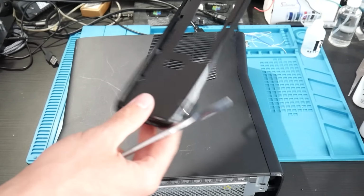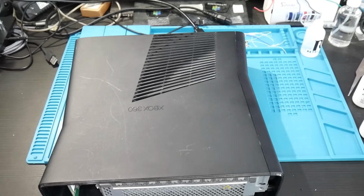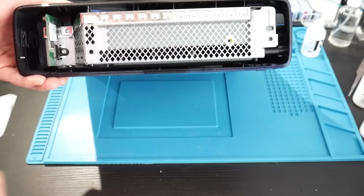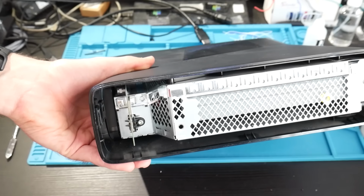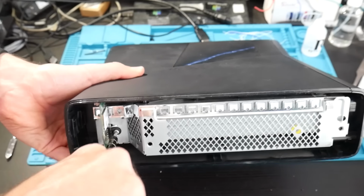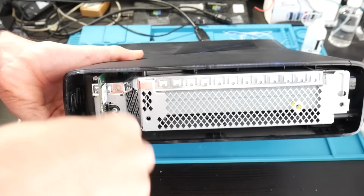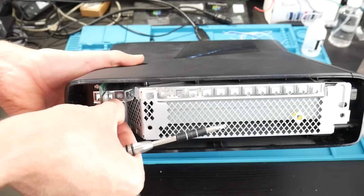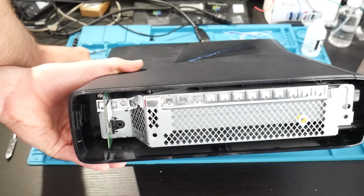In my opinion, those are the two hardest parts of taking apart the console. So the rest of it is pretty easy if you have the right pieces. Now at the top of the console is the Wi-Fi board. Just take your T10 security bit and unscrew the single screw here holding this down. Once you have it unscrewed, remove the Wi-Fi board and just pop these somewhere safe.